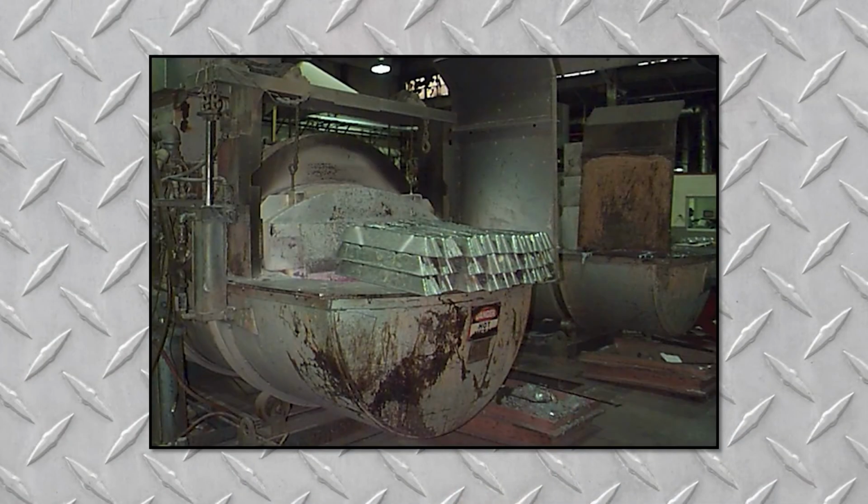What we tend to recommend is a staging hut for a waiting charge. By charge, I mean the pre-melted product going into a furnace. Shown here is a case with ingots that are going to go into the furnace and are set on top to preheat before going in. Without this step, the heat coming off the heater would be just wasted.